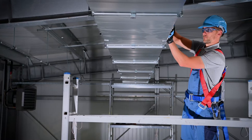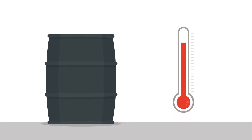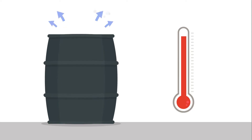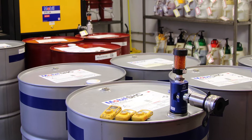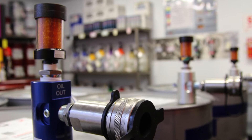As the storage area is climate controlled, we're able to filter the air and maintain a stable temperature, which minimizes breathing of the lubricants. As lubricants breathe, anything in the air is going to find its way into the lubricant. When storing oil drums, many people store them horizontally with the bung and vent at the three and nine o'clock position, putting them below the oil level and providing a hydraulic lock so the drum isn't breathing. If storing vertically, especially with big temperature swings, it's a good idea to put a desiccant breather on them to help keep the lubricant clean.